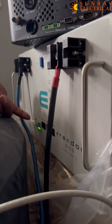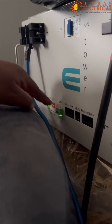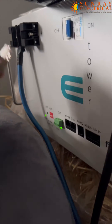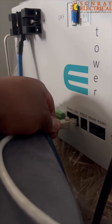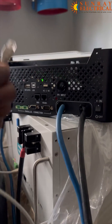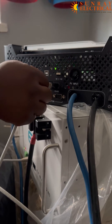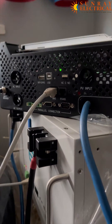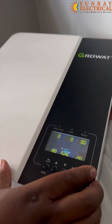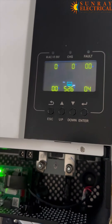So then we go to the battery. That's our lithium battery. The CAN address we set on number one should be up and on. Then we connect our comms cable on the CAN port, and then connect the other end to the BMS port here on the inverter. Check on the screen — it should take at least about 30 seconds to sync and to clear that error.